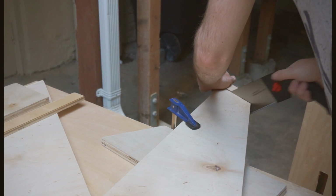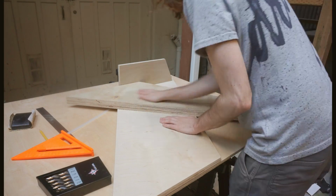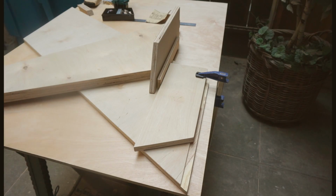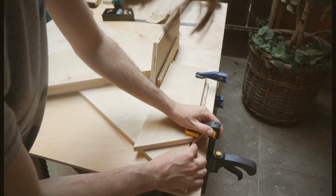And in doing so, I discovered that I had actually cut the legs of the desk a little bit too long. Once I had fixed that, the idea with this jig is to set the side of the desk so that its bottom is parallel to the ground, and then clamp in place one of the dividers so that it overhangs that rabbet by 1/4 inch.